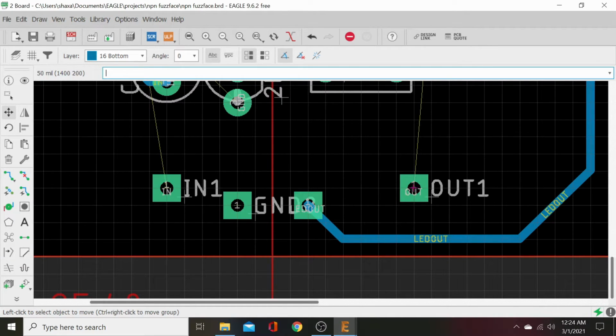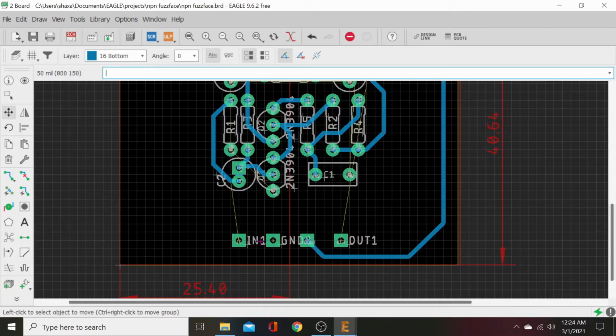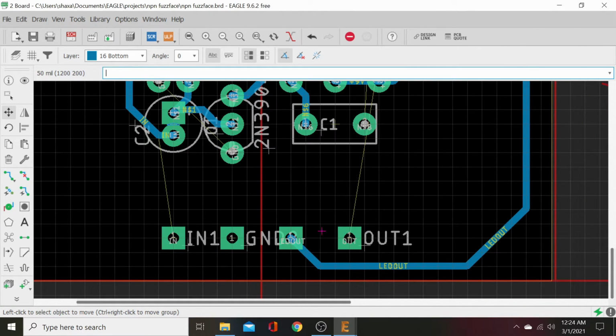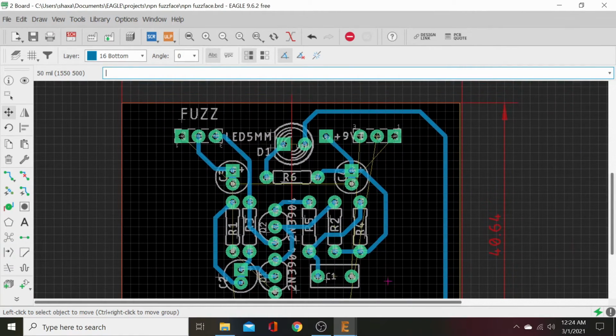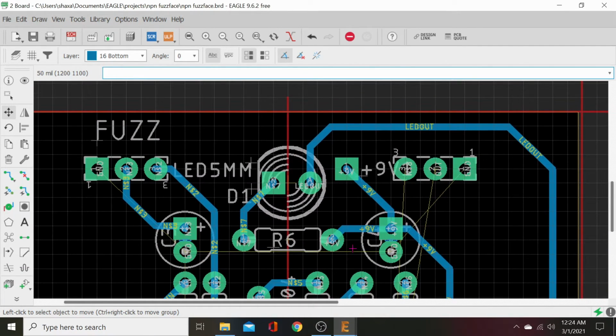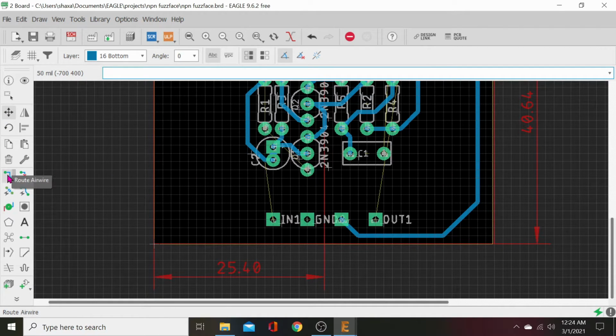All right, still on our move tool. Let's bring this down. For right now, we're going to set that right there. Yeah, that's good. They're all lined up. You can check your grid spacing. Four squares, perfectly centered and spaced from the edge and from the center. And we can check that with our resistor too. We've got that just right. 1.5, 1.5. Everything looks good there. Pots are spaced perfectly. And there, my friends, we have it set up. So let's finish the rest of these traces.